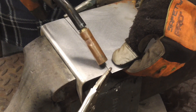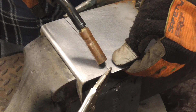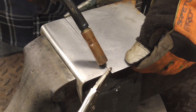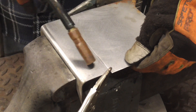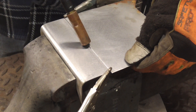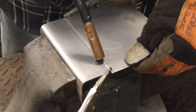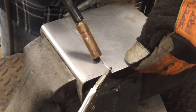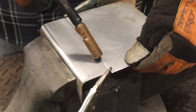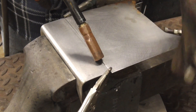When I go to weld, I just find that and then I know my spot weld is going to be exactly centered right where I want it. So put it there at a 45-degree angle and go all the way along. Another thing is you can roll the welder or turn the trigger a little bit to extend the spot weld into a stitch weld.